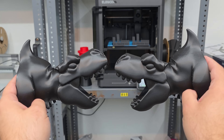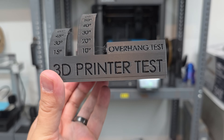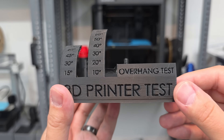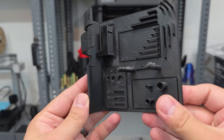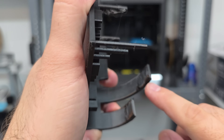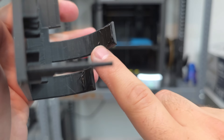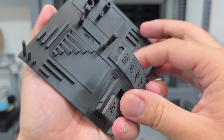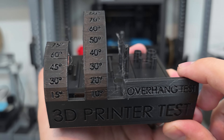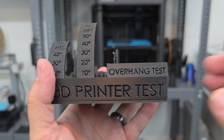This next print is a stress test for both printers. I did get some really bad stringing on both — it could be cooling-related since I'm printing extremely hot. The main difference I found is in the overhangs on one side. There was also a slight layer shift on one of them, but overall the print handled the stress test well. I only attempted to print each one time.